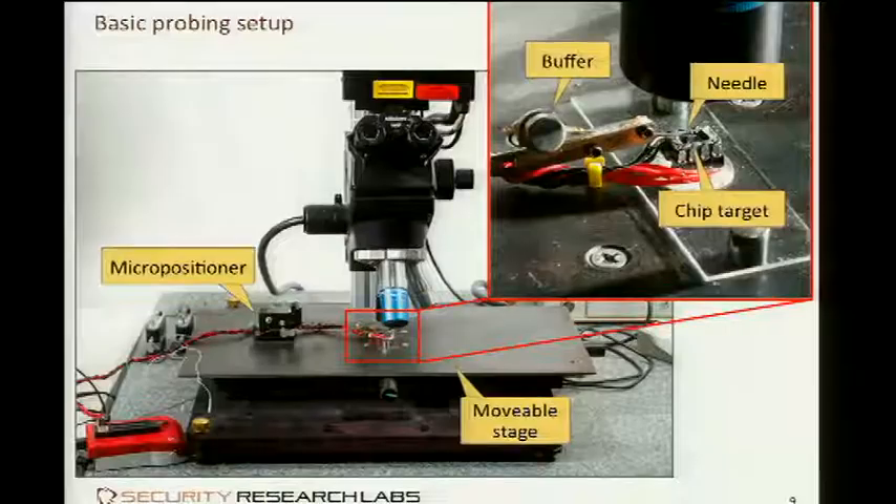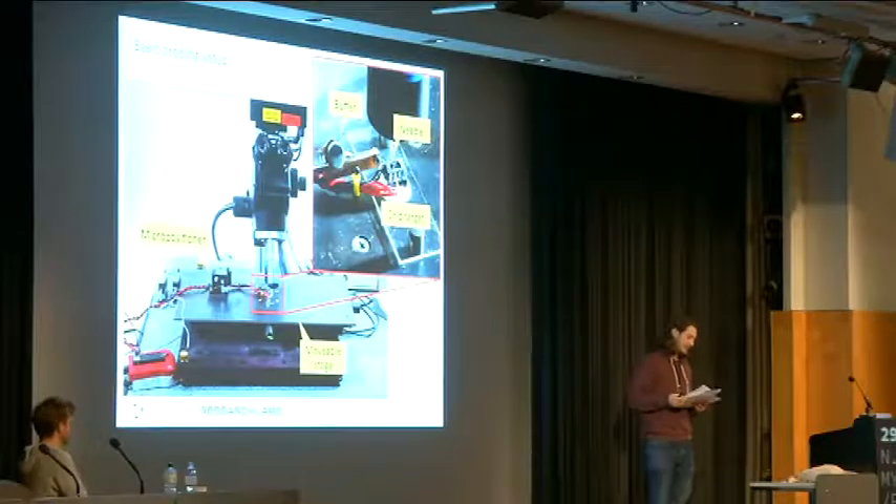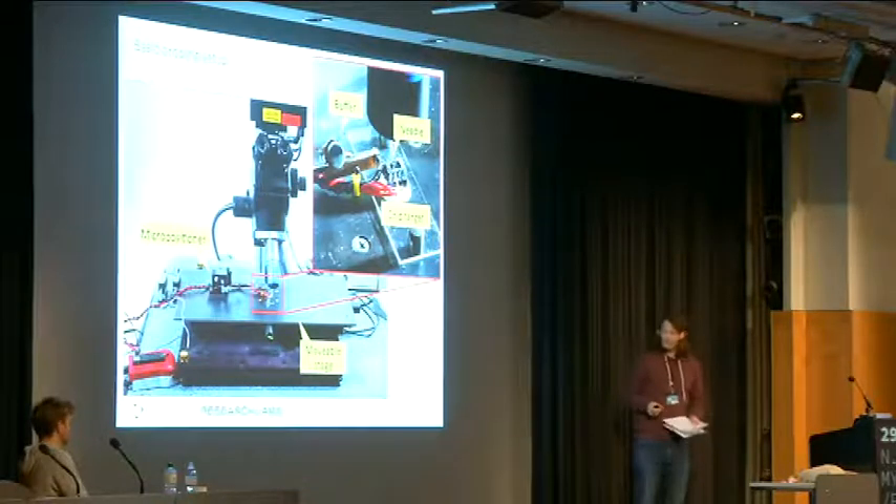This chip has already been hacked. Normally when you hack one of these devices you would use a UV attack: UV light erases the microcontroller including the fuse. But if you cover the EEPROM memory with paint when you find it on the chip, it cannot be erased anymore — but the fuse gets erased, so you can unlock the chip and read back its contents. The cables here run down to an EEPROM programmer, which is the red little thing. Whenever you probe something, you have to set the chip in function, giving it a controlled environment where it can work.